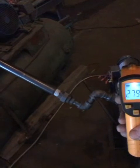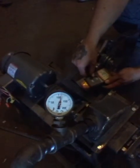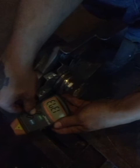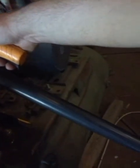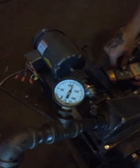And that is why it's important to understand how these work. We'll give it another minute and come back. Pressure is 110 PSI — came up 5 pounds. RPM is 1,373. The reason is because the temperature is now 299 to 327 degrees. We're at 1,400 RPM — and the same pressure as we had zero RPM at the beginning with cold, relatively dry air.